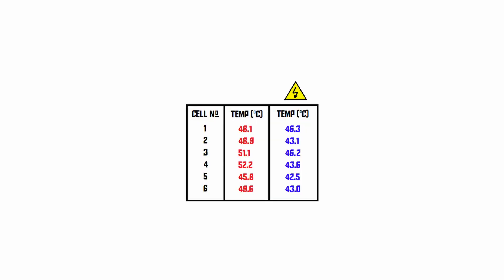Here's a table that contains all the results from our tests. As you can see, in the second test — with the solar panel active — the temperatures are noticeably lower than in the first test. So the theory has been confirmed, although I wouldn't call this a very scientific test. I did repeat it a couple of times and got similar results: noticeably lower temperatures with the solar panel turned on. It's quite cool to see this theory apply in the real world. To be honest, I didn't expect it to work this well — I expected the difference to be much smaller and harder to detect. But apparently it was multiple degrees, a very significant and noticeable difference in temperature.